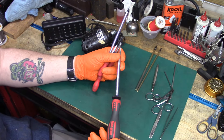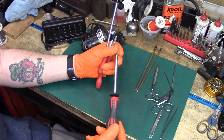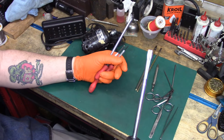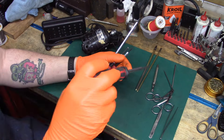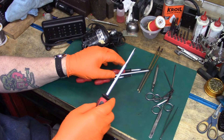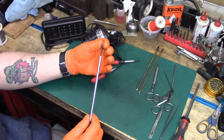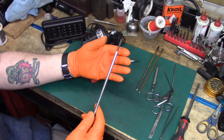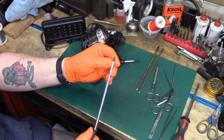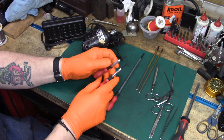This one here is Quick Wedge - I bought these through McMaster-Carr. This model 1836 is great for holding the mounting screws for potted motors to get them down in there and get them started. You don't drive screws with these - you start screws with them. How it works: you select the correct screw starter for the size, put the screw in, then slide the little barrel here, and it wedges the screw starter onto the head. I've got various sizes and various configurations.